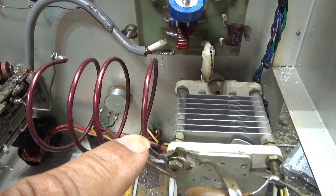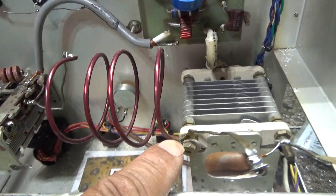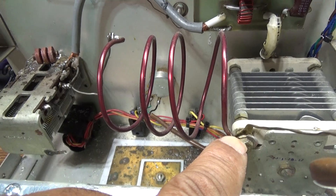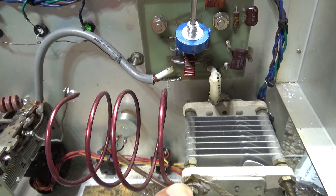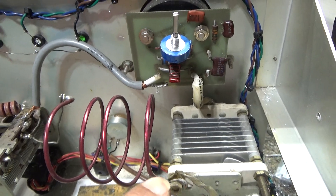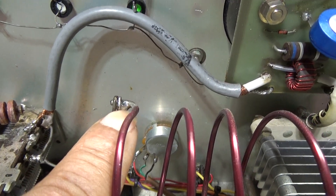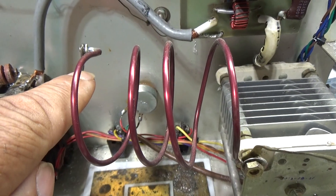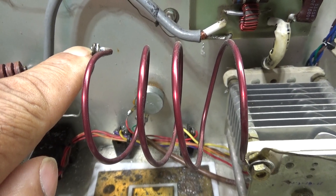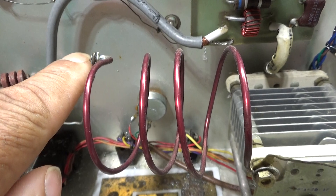You need about four turns of coil. This is the original coil from the Pride DX 300 — it's originally the first thing in line, and that's originally where it was tapped, or it went to the other coils. That's all you need — that coil there, those four turns of coil, for a mono-banded Pride DX 300.